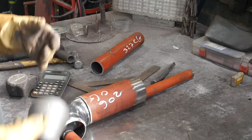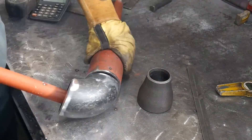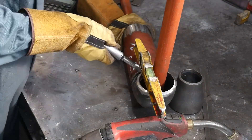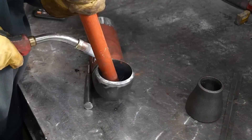Once that's welded I could start tacking together some of the three-inch pieces. I'll weld it now so I don't have to weld it later on when it's a completed pipe — that's one less weld to do with a whole bunch of weight and awkwardness, as well as one less weld to pull. There's a pipe spacer so I can root it at a higher power, so I do it at 125 amps synergic, and then I cap it at 165 amps.